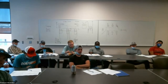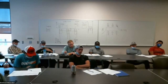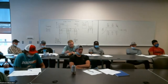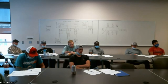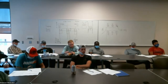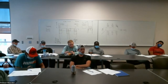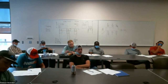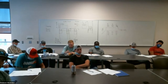This has got a bypass handle in it. You lift the handle up, there's a connection in the middle where the bars meet, you pull the meter out, and it actually loosens the jaw. Put your new meter in, throw your handle back down. They never know they lost power. Never know they had no electricity. Pretty cool, huh? So that's for a meter where they track how much electricity you use, but all electric meters do that. Yes. We'll get more into meters later on.